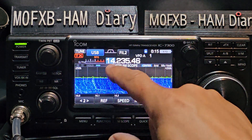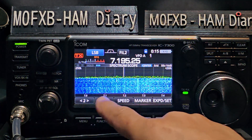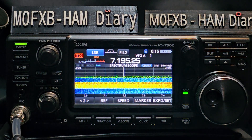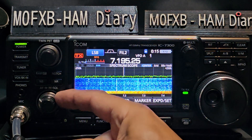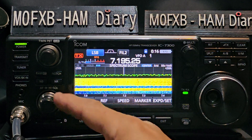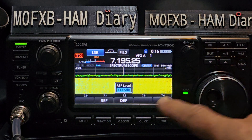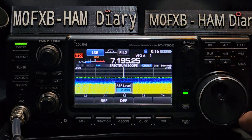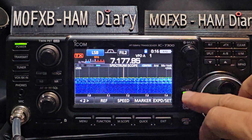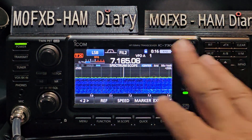Not much there. Let's try 40m. Remember, if it's a bit hot, make sure there's no preamp on — that'll help. You can also pull the RF gain back a bit, though I don't like to pull it back too far. And of course noise reduction helps your ears. If you press 2 then go to Ref, it's like a waterfall gain — pull it back and you can really see those signals. Tap it to get rid of it. Something this morning is wiping it out — it'll come good later, it always does — but you can see the trickly effect on those weaker signals.